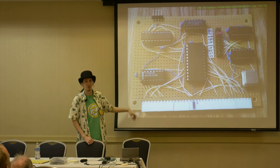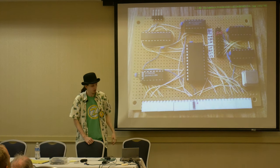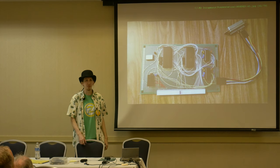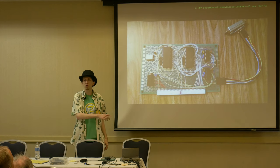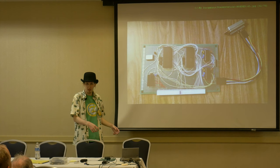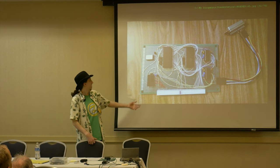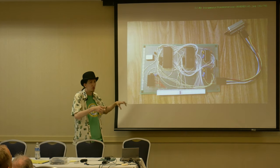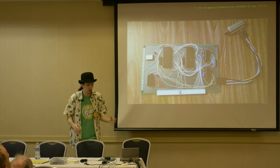To be able to use BASIC, we've got to talk to it over serial. We've got the Motorola 6850 — we can switch baud rate with a jumper. But I don't want to switch baud rate by hand. Then somebody shows me the 6551 ACIA — you set the baud rate in software. You can change your baud rate on the fly, and it's not nearly as dense in terms of support circuitry. We can fit two of them on there. Serious serial interaction.